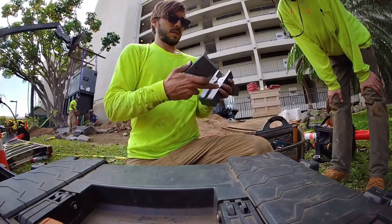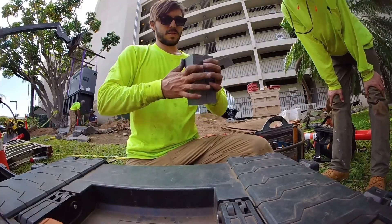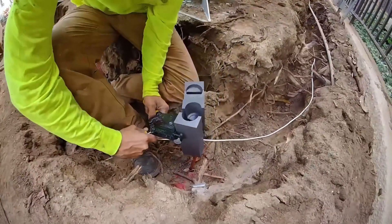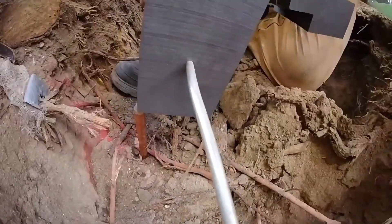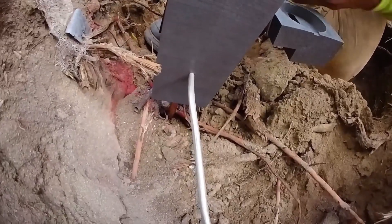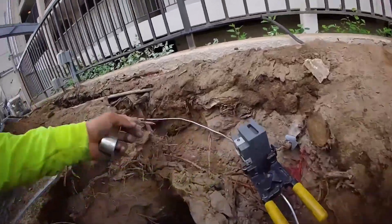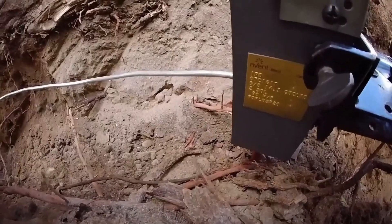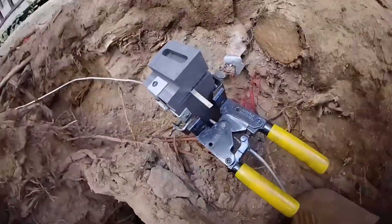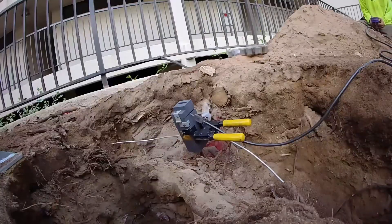One thing that's important — it doesn't have to be two pieces of wire. We can just clamp it over the same one, clamp it over like that, and then just set it on top of the ground rod. So here's our ground wire — we will clamp onto there, clamp it on like that, and then it'll just sit right on top. Push it down — I can hear the noise that signals to me that it's pushed all the way down. Now we'll add our charge. This one must require 90? 90-plus. Plug the igniter onto the tab. Fire in the hole!